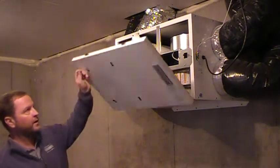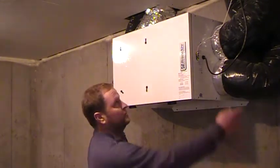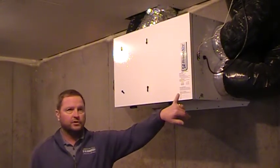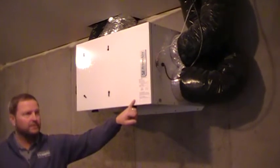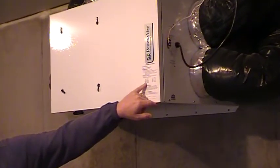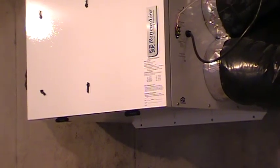Now I'm just shutting the door, putting the clasps back on, locking it — plugged in and ready to go. On the outside of your air exchanger you're going to see a little sticker. This is the installation supplement by the state of Minnesota for testing. Based on the square footage and the number of bathrooms in this house, it will let you know you should run your air exchanger at 50% of the hour. To control and operate that, follow me.